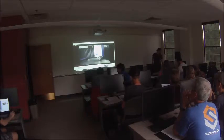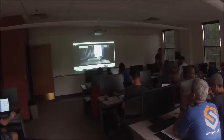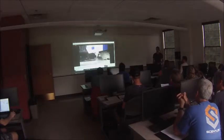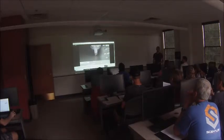Anyway, so you have a nozzle that's pushing gas out in the same path that the laser beam is firing. As the laser melts and vaporizes the material, the gas, which could be nitrogen, compressed air, or oxygen, pushes the molten metal out of the cut and makes a nice clean cut. And lasers are really fast. I mean, that's cutting complicated geometry within a few thousandths of an inch pretty quickly.